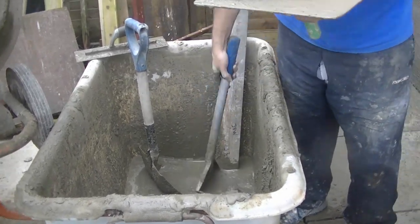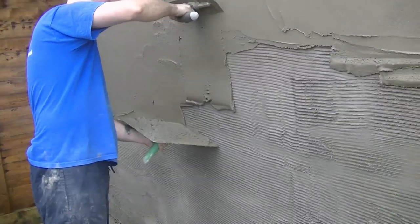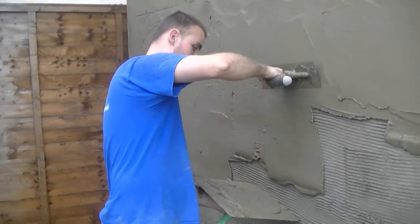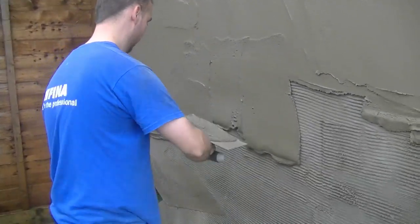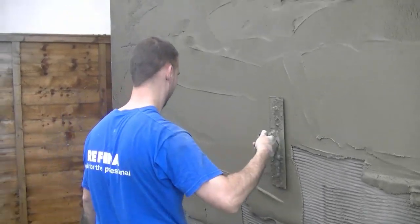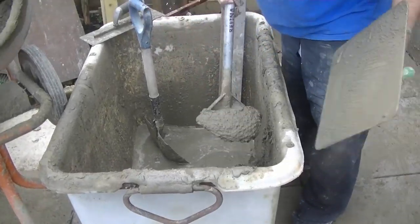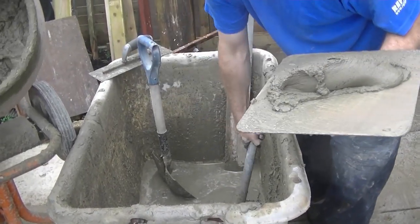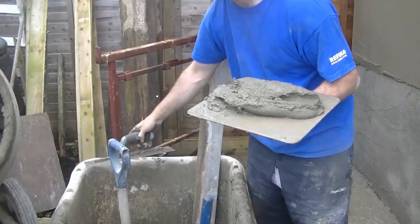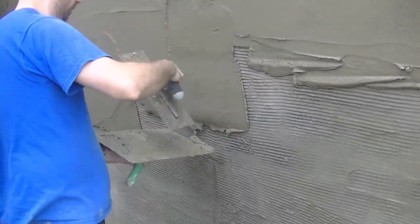The way I go is left to right — I take it from the top down and keep bringing it down. When I'm going to straighten this out, I'm not straightening until I get it all down. If you feel it pulling in, you might want to start straightening sections, or wet the wall further down to give yourself a bit more time. I have the top straightened, so I'll be straightening off that top area and off my two corners, pulling up off the two corners also.